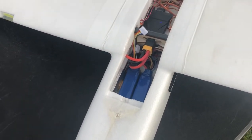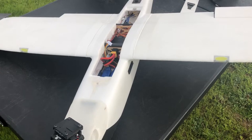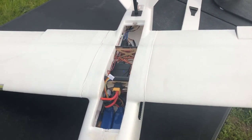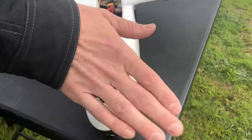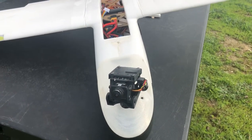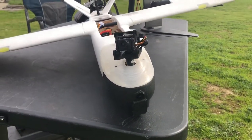This is run by lithium polymer batteries. It has a flight controller here with a gyro built-in and a stabilizer as well. There are a bunch of different modes: cruise mode, which is basically altitude and heading hold; fully manual mode; and loiter mode, where you can spot something interesting, loiter over it, and point the pan-and-tilt camera — which is a 360-degree camera — at it to look down. It also has the return-to-launch mode.